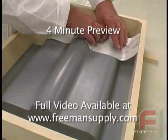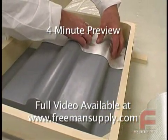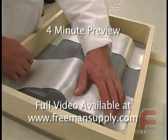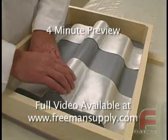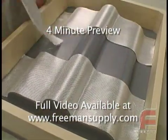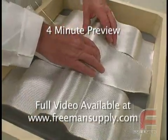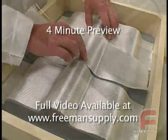Note that we are fitting our layers of fiberglass prior to applying our release agents. This is done to prevent us from disturbing our carefully applied release agents and thus requiring possible reapplication. Our goal, especially for the first layer, is uniform coverage with no overlapping joints. Although a tool doesn't need to be as precise as a finished part, the more carefully we fit our fiberglass, the easier it will be to build the mold.